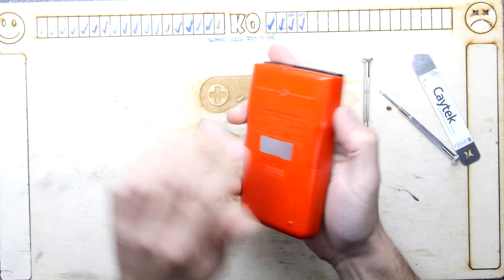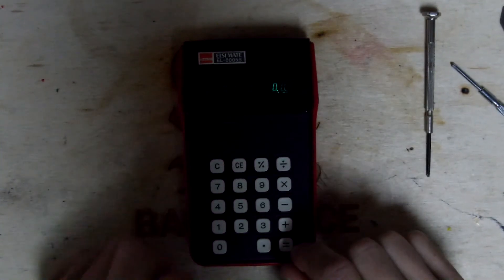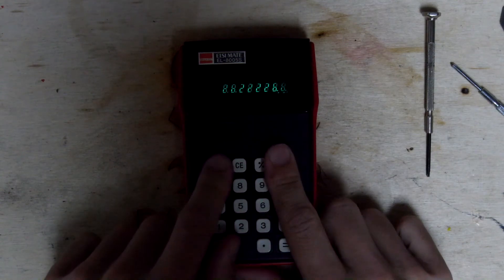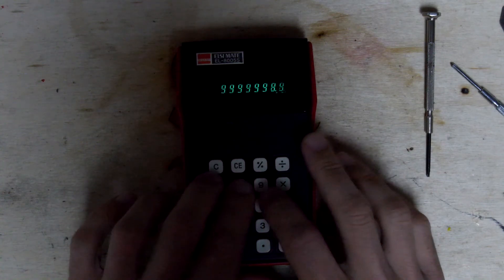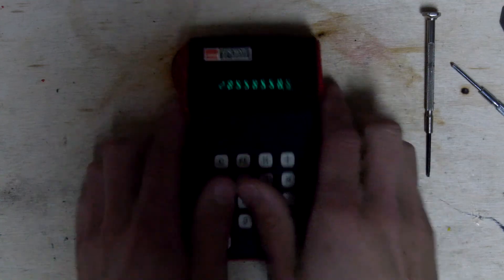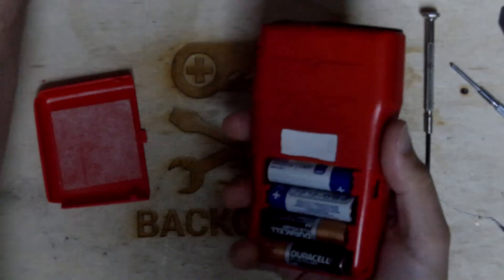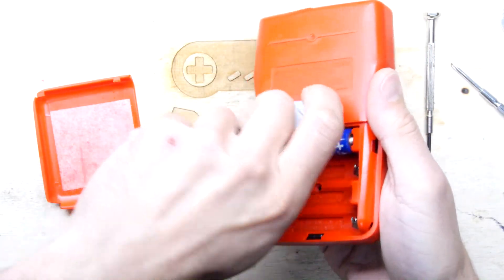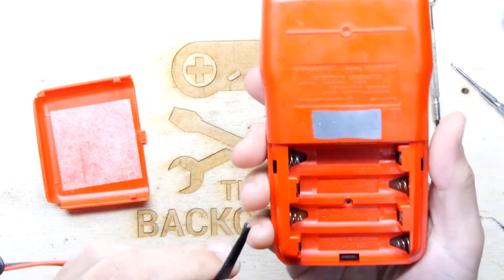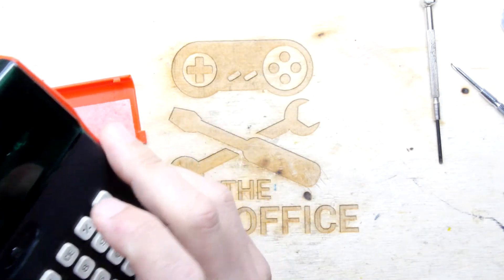I can see numbers — these are going to be really hard to film. So it seems to have like two digits, and a digit, and then a digit. Is that like a date thing? One, two, three. Okay, so it seems to be possibly suffering from some other ailment. What if it's down to not having enough juice? We've got a bench power supply here — let's turn that all back on again, take the batteries out. We've got the bench power supply set to a healthy full-on six volts.